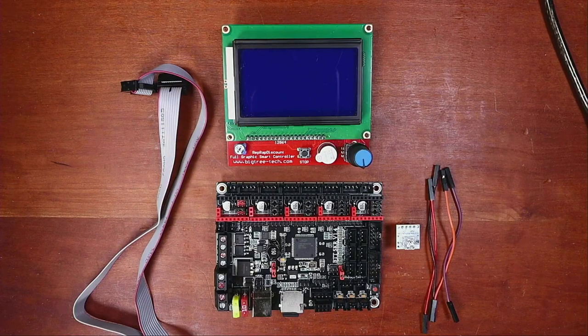Today we're going to talk about how to install an i2c BlinkM on the BigTreeTech SKR version 1.4. The first thing we need to do is locate where the i2c pins are, so we're going to go over to the web browser and find out where they are in the pinout diagram.